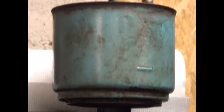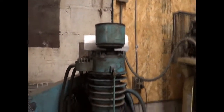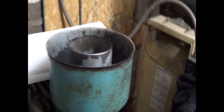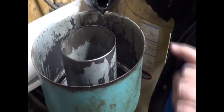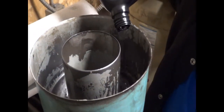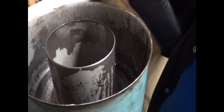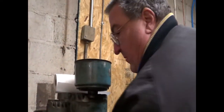This will be 30-weight non-detergent — same oil that goes in the crankcase. We'll fill to this line, then we'll clean the element and put it back together. This just became a bonus episode because we actually realized there's a lot of you young fellas that may have never seen a filter like this. And we're right there at the line — that is full. All we have to do is clean our filter element now.